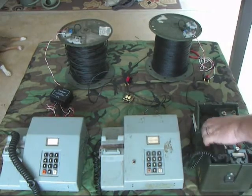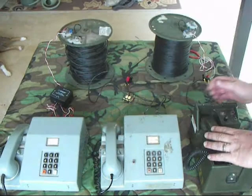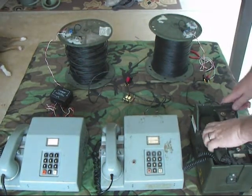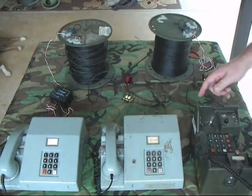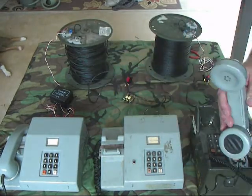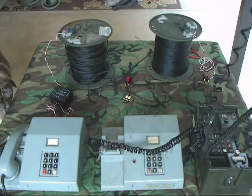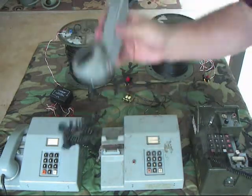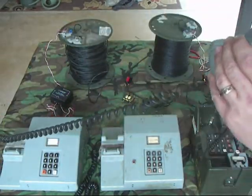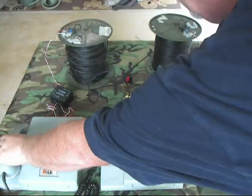Let's hang it up and try again. Picking this phone up — both of those rang. Test one, two, three — that worked. Putting this one down and picking this one up — it rings back. Test one, two, three. There we go, it works. All combinations of phone pairs are now communicating successfully with the transformer solution in place.